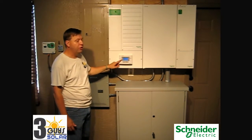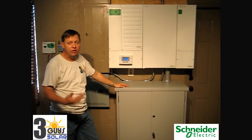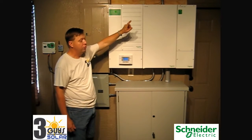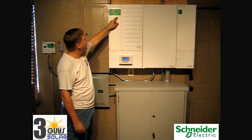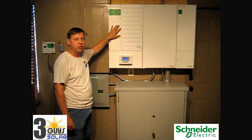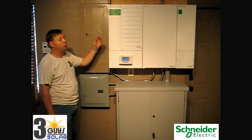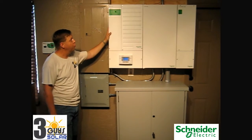You can try to clear event warnings off of the display screen, but if you have an AC output fault, you're not going to be able to clear it because it is a current fault log. You'll notice that our battery power is still staying at full power. We should have enough power from the solar to run all of our critical loads in the house, but you'll want to watch that during a power outage. We're running about 1.26 kW — that's the energy the inverter is converting from our batteries and solar, from 48 volts into 240 volts to power our loads. Our loads in this case are about 1200 watts, and we want to make sure we're not exceeding the 5000 watt rating of the inverter.